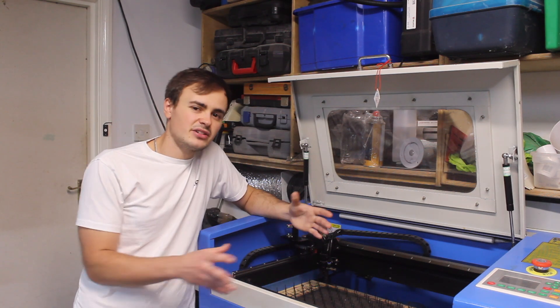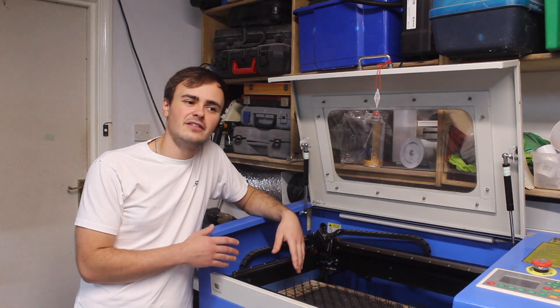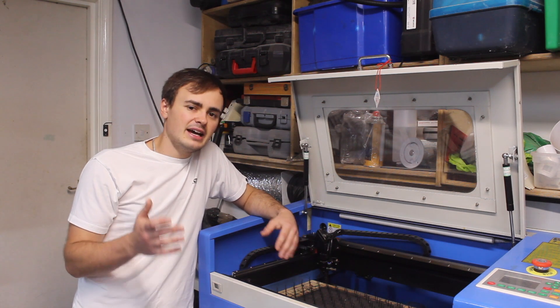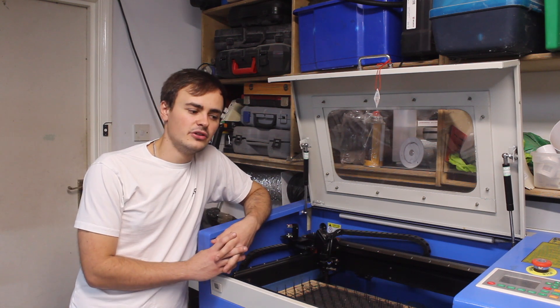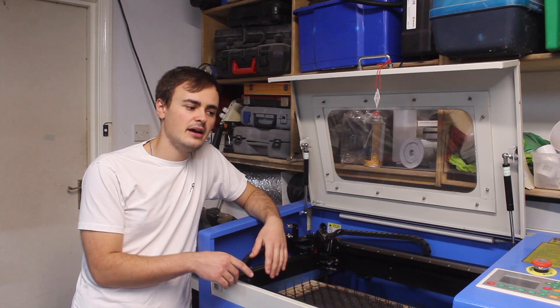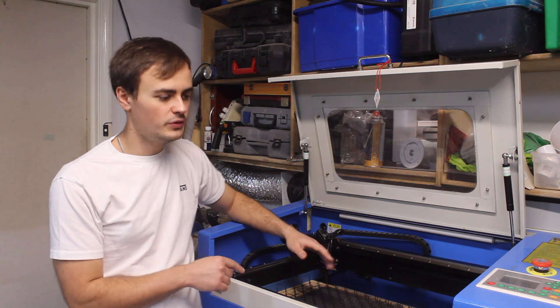This is a medium-sized hobby laser — a 50 watt tube — so it's good for cutting anything up to about 6mm material. You can also get a slightly smaller machine, the K40, which is pretty good as a starter laser cutter. It's a desktop laser cutter, very similar to this, but you have to use different software as this machine has a Ruida controller.